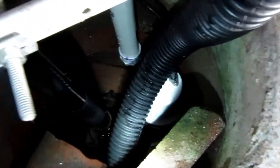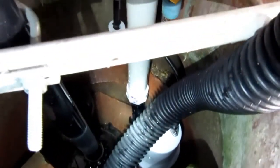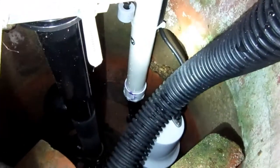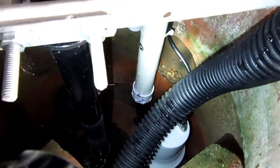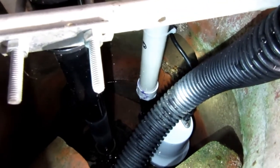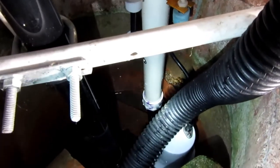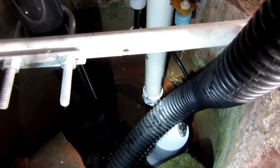Anyway, the new Basement Watchdog pump is down there, and it's just like the old one — I can hardly tell the difference. I've got a standpipe, or riser pipe, coming up. You can kind of see down there where the black dot is — I circled the hole. You're supposed to drill on the side of there. It's a downward-facing eighth-inch hole safely above the water line, as they recommend, and that's to prevent an airlock that would prevent it from starting properly.